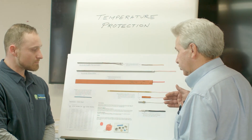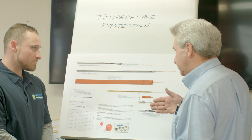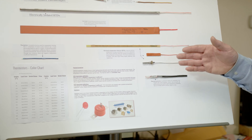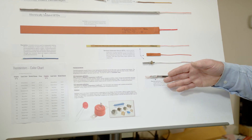Generally you want to make sure there's not a problem causing this to happen. One occurrence might just be temperature-related ambient conditions in the building. If it's happening more than once or twice, the customer needs to figure out what's causing the problem. Does the motor have a higher current draw because the load has changed? Is the unit getting hot? It could also be a bad thermal protector.